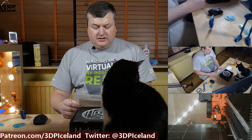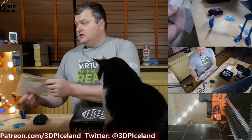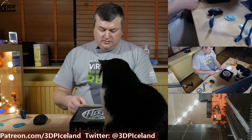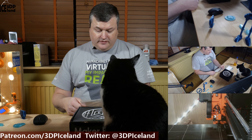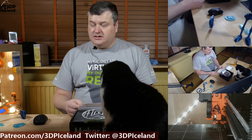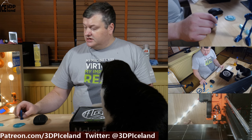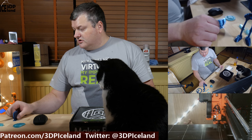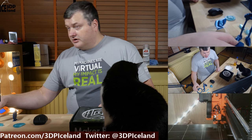The second filament I tried from this sample is PETG Pro from Atomic Filament. This filament is a PETG filament that prints at 230 to 245 degrees with a heated bed at 60 to 75 degrees. This filament is pretty easy to print with and it gave me only one small problem — some stringing — but other than that it came out really well.